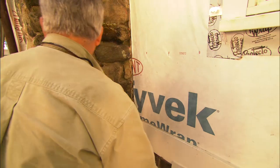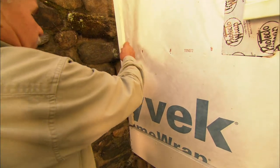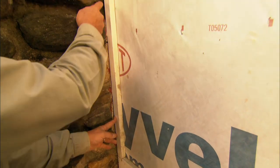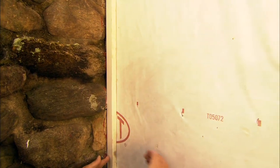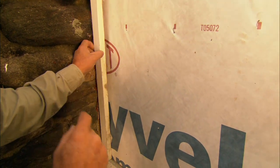What I want to do is take a piece of trim board — the same type of trim used on the rest of the house — and actually frame around the chimney with it. We'll create a nice tight joint here where it meets the chimney, give you a straight edge for your siding to die into, and it'll be watertight. To get started, let's get some trim board.